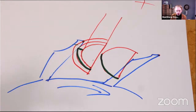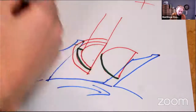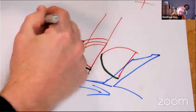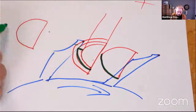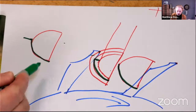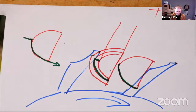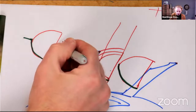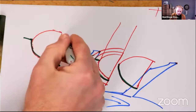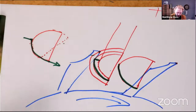So you just cause more problems. What I've seen a lot in a case like this, where you can only get pallet stones that are bigger diameter, is that people put the stone in the frame and they rotate it. So rather than it being like this, where our escape wheel tooth lands here and slides down here as the pallet frame rotates, and it drops off in that direction, I've seen this pallet stone rotated in the frame like that to decrease this value here. And to a degree, that works.